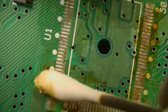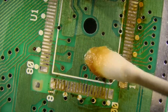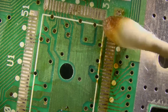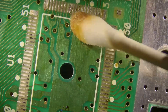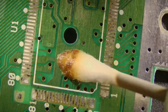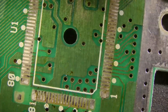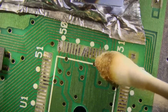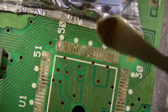Just some 99% isopropyl and a standard q-tip — just a light amount of pressure. We just barely want to rub over those pads so we don't rip them up. You can see how easily that alcohol just cleans that flux right up; you don't need to scrub too hard to get that off. There's a little bit of flux from where we dropped the chip that's on there pretty good, but that's no big deal. Just a bit of a perfectionist — like to get it cleaned up as best as possible.